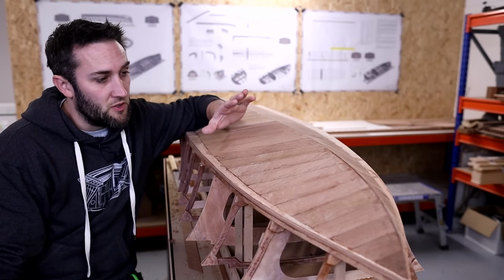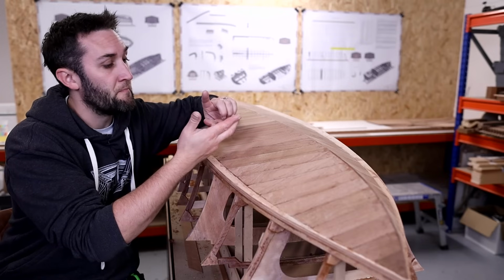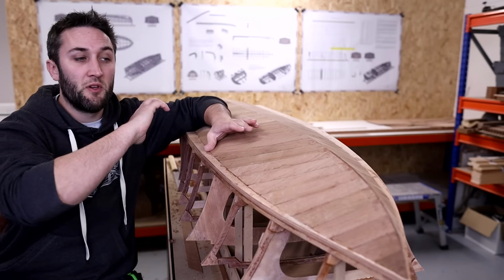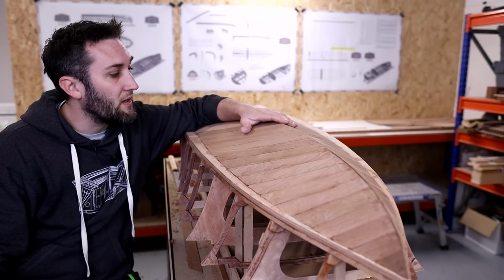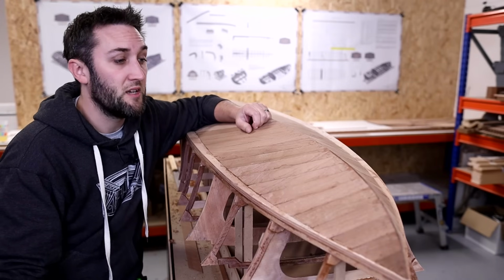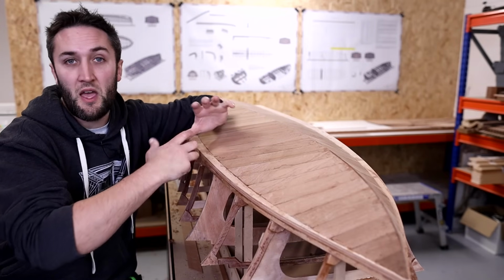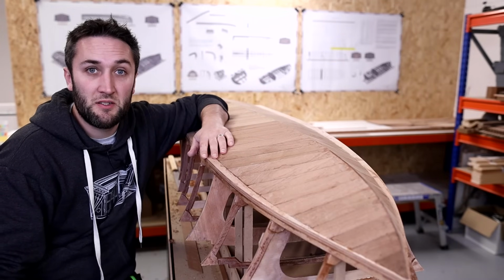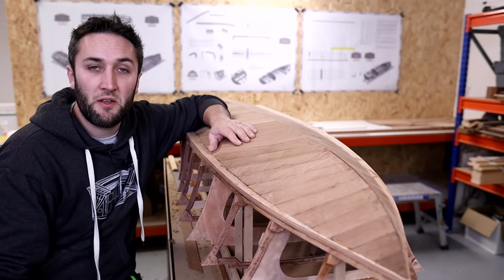And then what we're going to do is completely seal this with epoxy. So we'll encapsulate all of these planks, and there are a number of reasons for that: to create a great moisture barrier between the two planking layers, but also because for the second layer we're going to vacuum bag it. So we'll look at the process for vacuum bagging planking in the next video, and see how it can be used within this process, how it's a really great method for getting good consolidation of the glue and exclusion of air within the laminations, and a number of benefits. It's a fantastic system that I really recommend you look into if you're doing a boat like this. So we'll take a look at that in the next video.